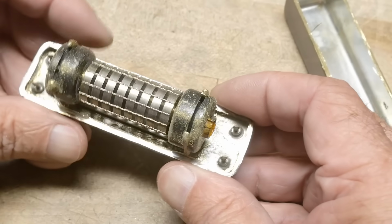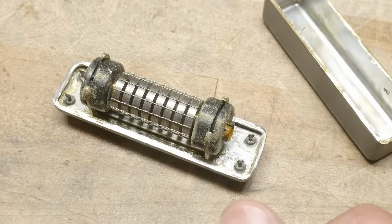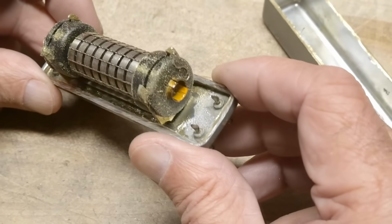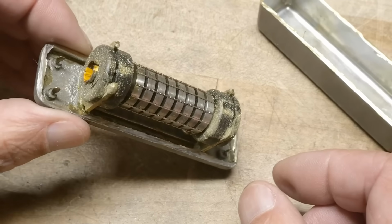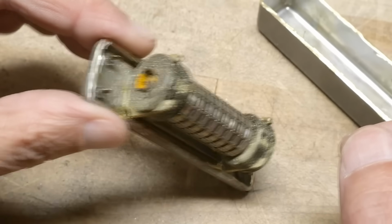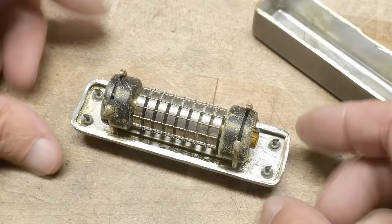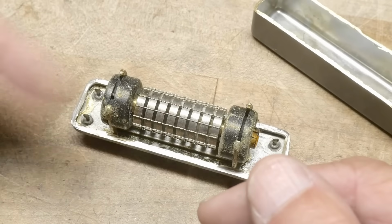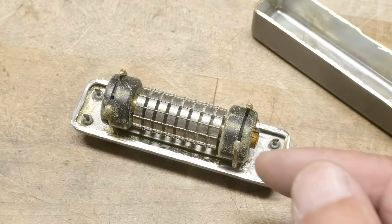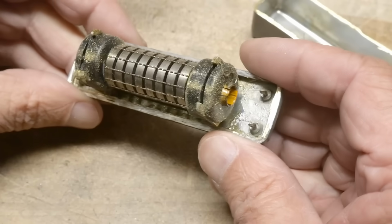I've seen the hand drawn. So if you look at the Collins filter data book, they give you a simple drawing of what's inside, and it looks a lot like that. So these two side things are coils, okay? And so we have the input and output. These are the inputs and outputs that go into these coils. So the coil creates an electromagnet, and then that goes to the device, and then this ends up being a pickup electromagnet, the opposite direction, converting magnetism into electricity. And that's the way it goes back and forth.